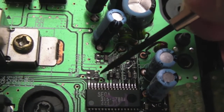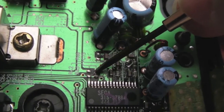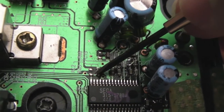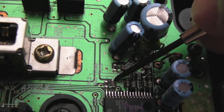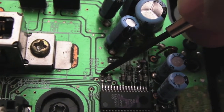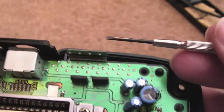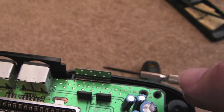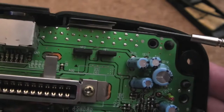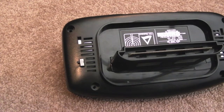The bottom pad of that jumper is connected to the bottom of this one. We're going to remove this link - it's like a zero ohm or 100 ohm resistance link. We'll stick a wire to one of these two bottom pads - that's going to be the center of our switch. The top side goes to ground and the other side goes to plus five, so we just need three short wires going to a switch. You just need to work out where to mount it on the back of the case, being mindful of the metal shield inside.